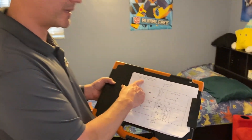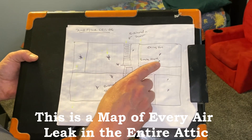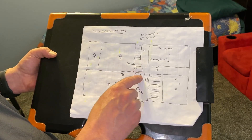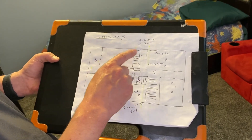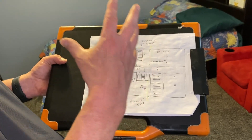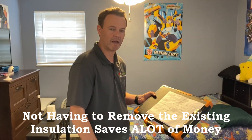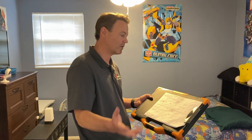We've just made a map of the whole second floor ceiling, so now when we go up we know that in this bedroom there's a ceiling fan and a smoke alarm; in the adjoining bedroom, a ceiling fan and smoke alarm; two hall lights; a stairwell void; a master bedroom with a bulkhead in the shower, ceiling fan, and smoke alarm; and a bathroom fan. This way, even though everything is covered in insulation, we know exactly where we need to go — and that prevents us from having to remove all the insulation, which would be a huge added expense, plus the cost of blowing in more insulation later.